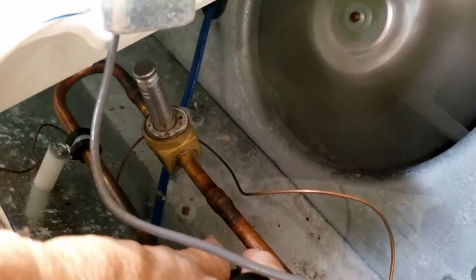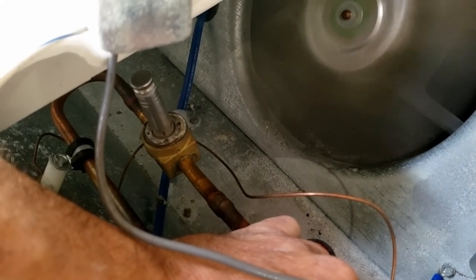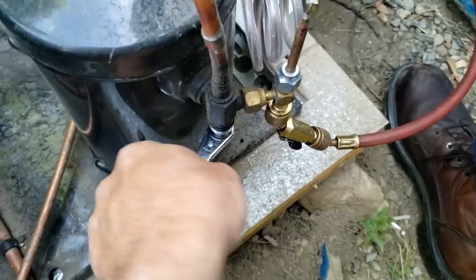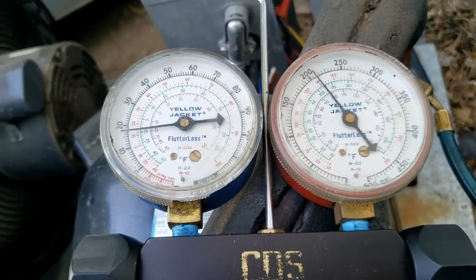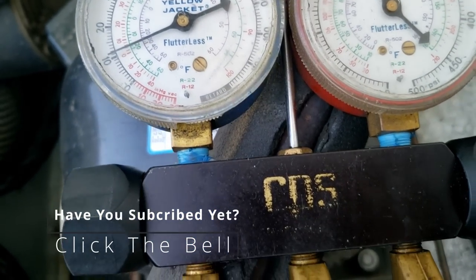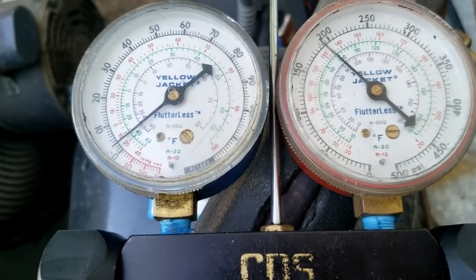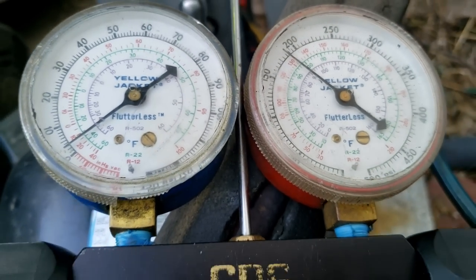It's definitely a little weird. I can feel heat coming through the filter dryer, and it just loops over there and back again. It's quite interesting - it appears I've just got a bad solenoid. Checking the suction pressure - not bad.